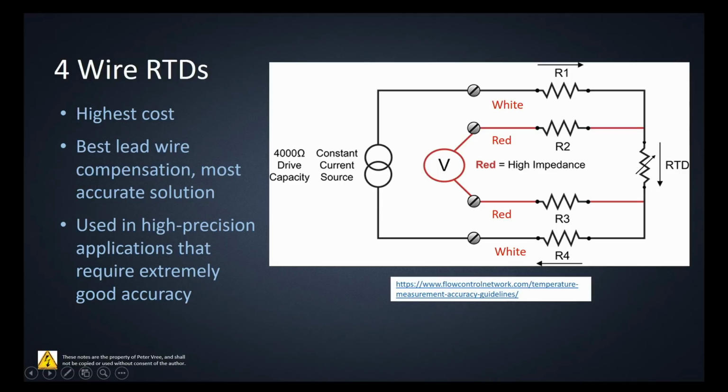So with the 4-wire, it provides you with the best accuracy available. And again, one more time, that's because the current is flowing through the RTD here. There's minimal current flowing here. Minimal current means that there's minimal voltage drop across those 2 lead resistors. And whatever voltage we're reading here is essentially the exact same voltage as you'd see right here across the RTD. So now we've got a great way, the best accuracy available, to get that voltage across the RTD transferring right into our microcontroller.